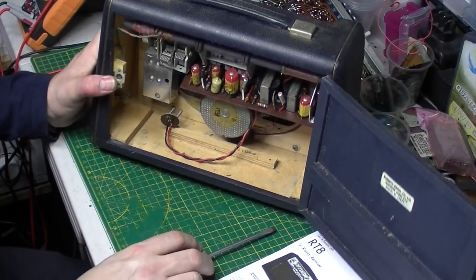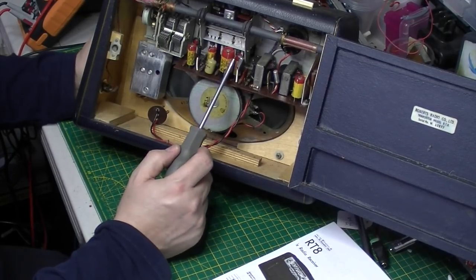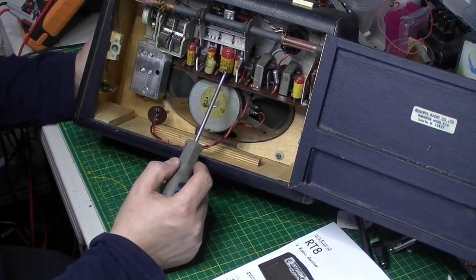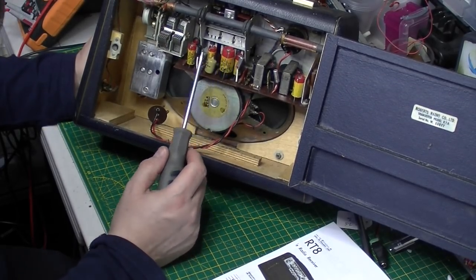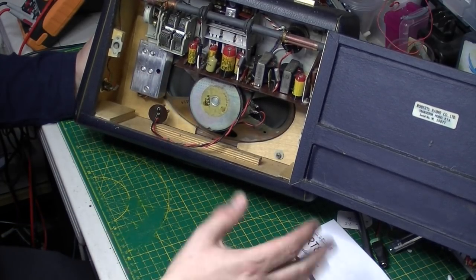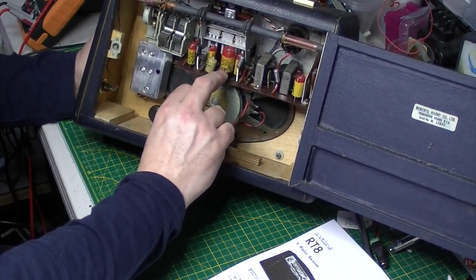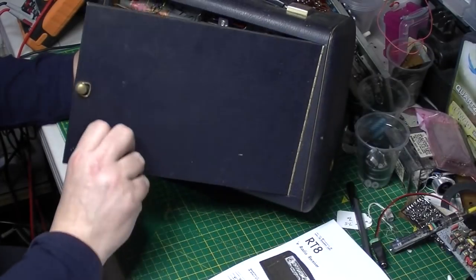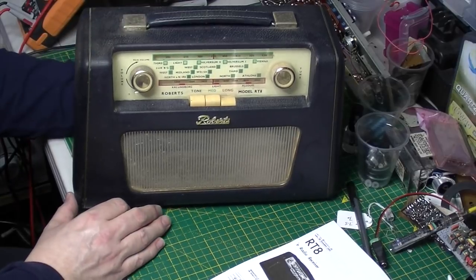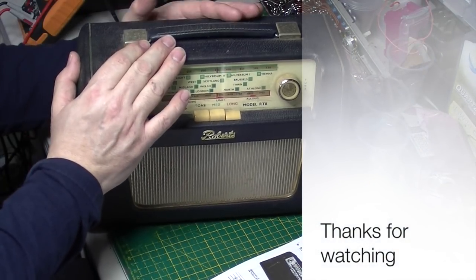It's going to need a recap. I think what I'll do — because I'm going to keep these — is restuff them. I've done it once before in the Dynatron TP11 Nomad. The Hackers and the later Roberts have all got those blue capacitors in so you can easily change those for modern ones and it still looks roughly as it should. These won't, but these capacitors will be shot to pieces I expect. So anyway there you go — another one that's going to be awaiting restoration. If you like that and the RT7, give me a thumbs up, don't forget to subscribe, and if you want to see more on these sets let me know in the comments. Bye for now.